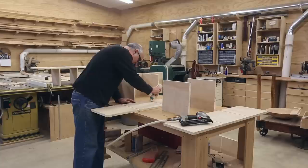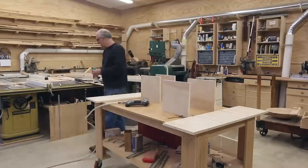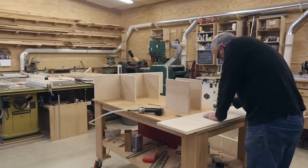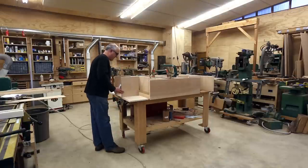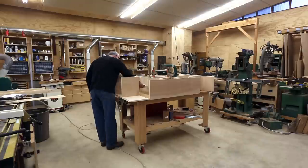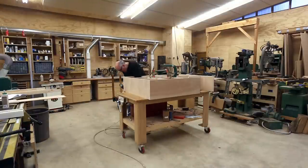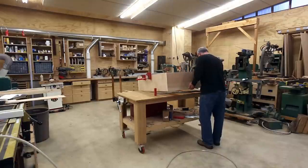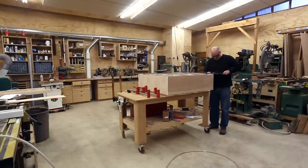Now I'm doing what the sketch was showing — building the center piece first and nailing it. Then we'll build either the top or the bottom, it doesn't really matter. We'll glue the top and the bottom to the center piece, then attach the bottom to the sides and the center to the sides. Now that this is all together, we'll clamp everything so it's square. I found it was a little bit out of square and needed one of my big clamps on the diagonal to get it into square.